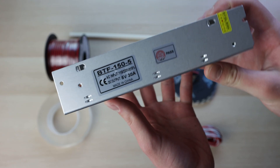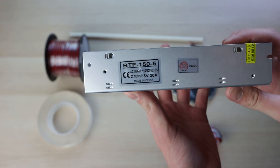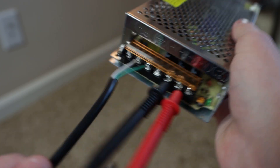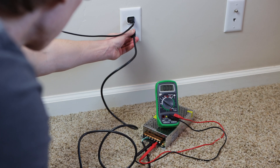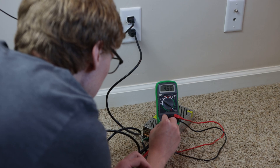The power supply I'm using is a 5-volt 30-amp power supply — it's kind of overkill, but I'll get to that in a minute. I hooked the power supply up to the wall, tested it with my multimeter, and made some fine adjustments. It's supposed to be 5 volts; I got like 5.08, which doesn't matter that much — as long as it's within 5 volts somewhere in there, you're good. Then I tested the LEDs out on the floor first to make sure they were all gonna work properly.